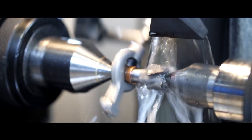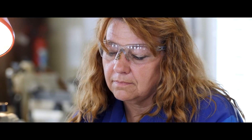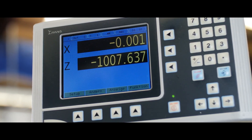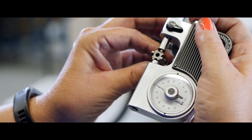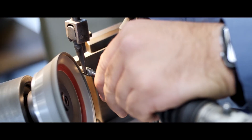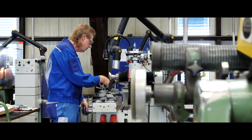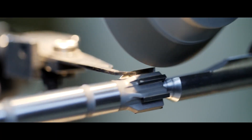It's all about getting the most holes out of this reamer. And as it starts to dull off, how far can I stretch or expand it before I need to replace it? It's pretty normal for these tools to be expanded three, four, maybe five times. And then eventually the wear on the blades and the surface finish of the hole kind of gets to the point where it's out of tolerance.